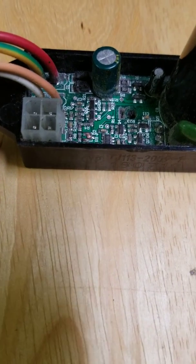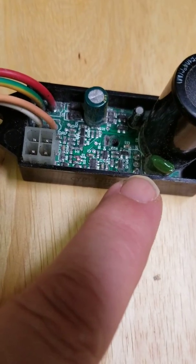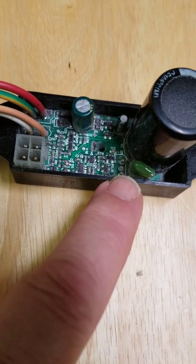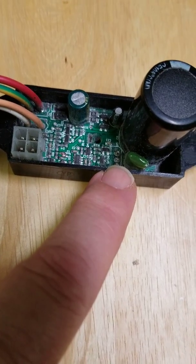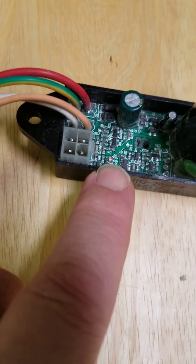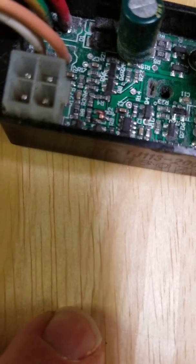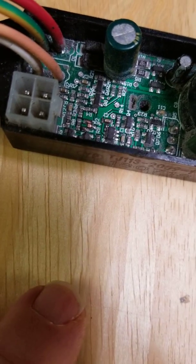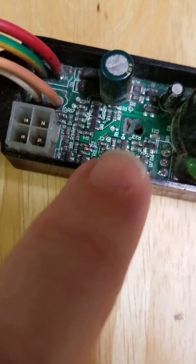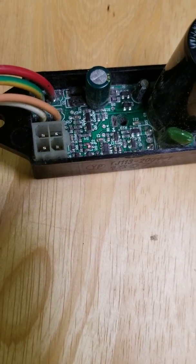This board is made up of surface mount devices — they're very small. You can see the SCR; I clipped that out because I actually found a replacement for it and was going to tack solder that into place. But in the process of doing that, I noticed over here you can see just a little bit of copper. There's a marker that says Q2. You're not supposed to see that copper; it's supposed to look like the black component right here. It's actually a surface mount transistor — it's got a base, collector, and emitter on it.